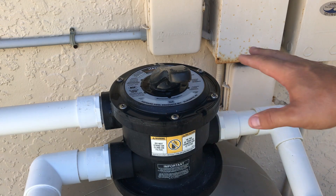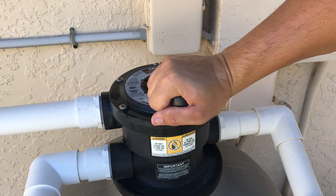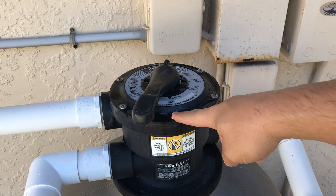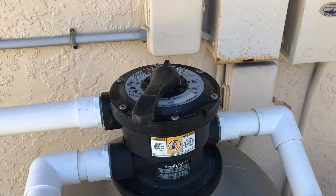This isn't a hard job, but there are a couple of things to pay attention to to do it safely. The first thing is we've got to depressurize this. What I like to do is go ahead and take the pump lid off, and then turn this halfway in between the setting to let the water drain out and depressurize it — and we need to do it anyway to get to the screws.